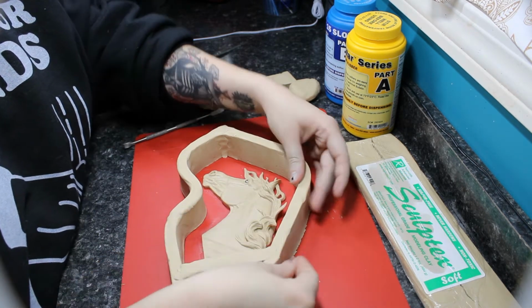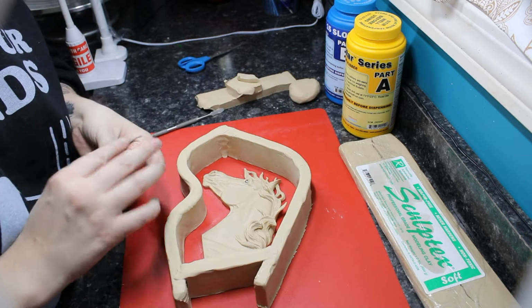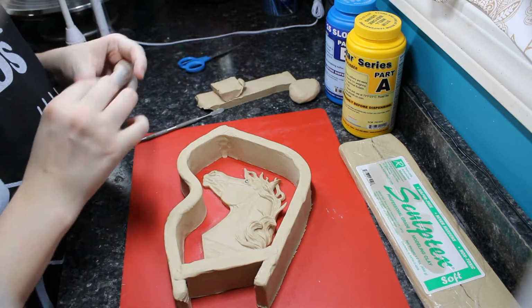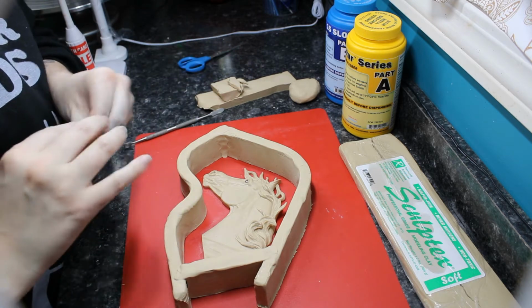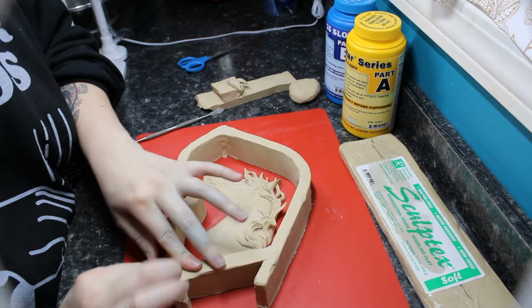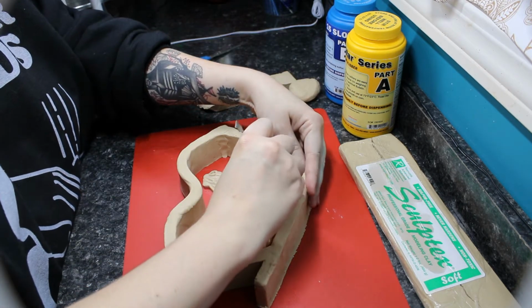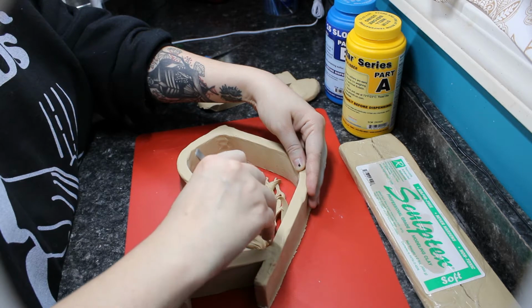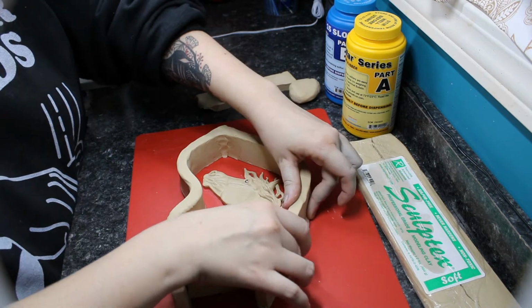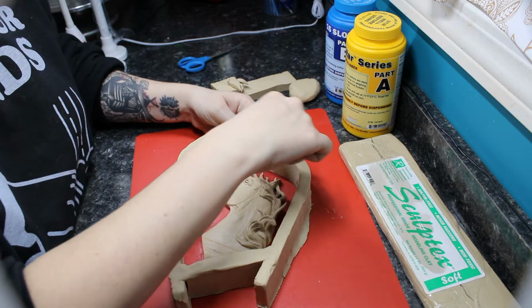Whatever clay you decide to sculpt your medallion in, or epoxy or Sculpey is also fine. If you're using a non-hardening clay like this, you want to make sure it is sulfur free. That is because sulfur will actually prevent the silicone from curing, and it is apparently very sensitive to this, because I used some tools sculpting this horse that I also used on a sculpture in sulfur-based clay, and there are areas of the silicone mold that I discovered at the end that did not cure properly. So I will have to make an additional mold after this.